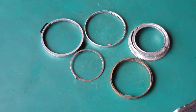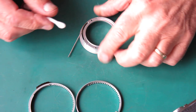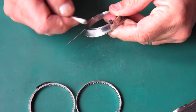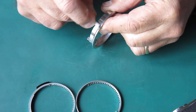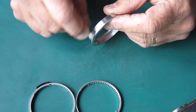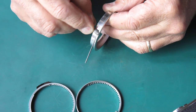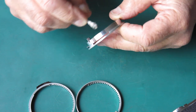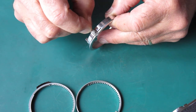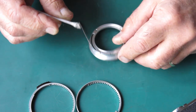I need to clean all of these with some naphtha and then put them back — hopefully everything will run much smoother. I'll start here, wanting to gather up all the dust, grit, and dried-out grease. Be careful of that spring — if you put a twist in it, it'll damage it and it won't run smoothly. It's not enthusiastic about unhooking from that little locator post, so I don't usually remove it unless I desperately need to.